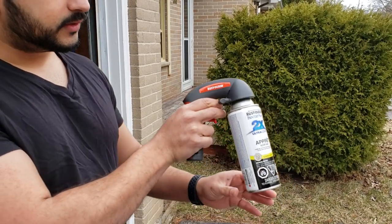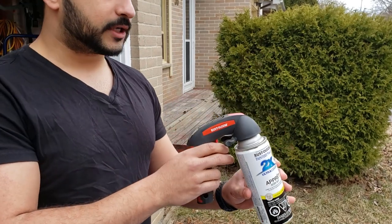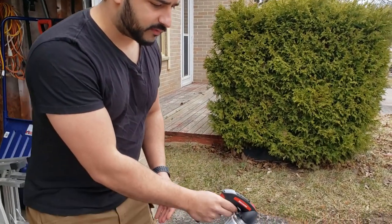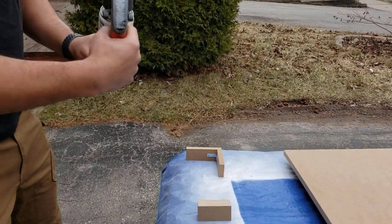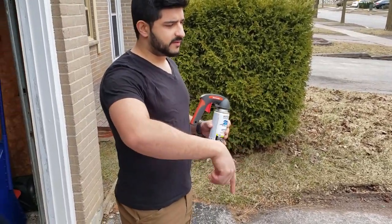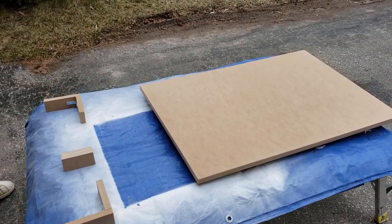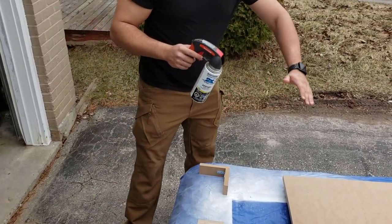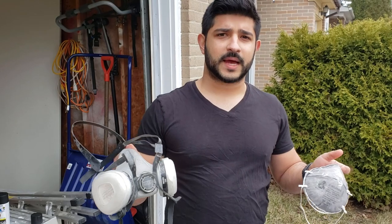The way it works: you've got a handle and a trigger — the red portion — which controls the nozzle. You want to be 8 to 12 inches away from your shooting subject. What I love about this product is the control it offers. On a surface like this, we have edges to do as well. Start with the edges first, then do the top at the end — the reason being so that you don't have any overspray from the edges going onto the top.